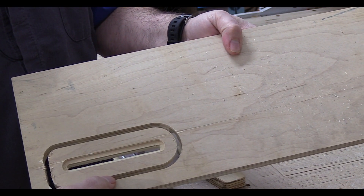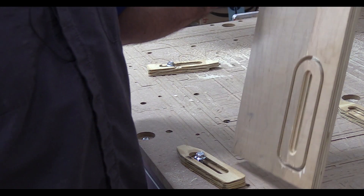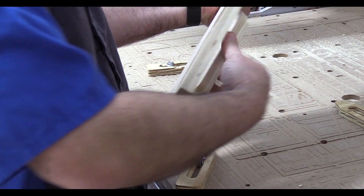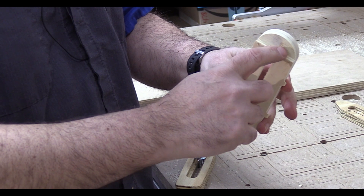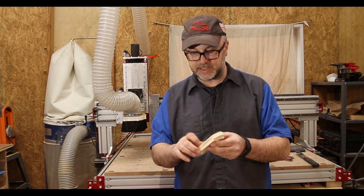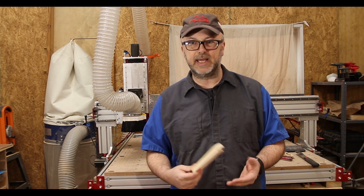You can see the part is still held in by the tabs, which kept it from coming loose, but that's pretty easy to cut out. A utility knife works fairly well; I find that a pull saw works perfectly. When two of them are out, you can simply bend it over and snap those off. We can clean it off and sand it down. Now you can see that things lined up properly — we have the notch. This didn't need to be extremely precise for that to line up, but you can see how by the reorientation it all came out properly. We have our finished piece. It's a fairly basic part, but it shows the basic techniques of what you need to do to design and cut out a part on a CNC router. Hopefully that's useful for you and you can get out and make something interesting.